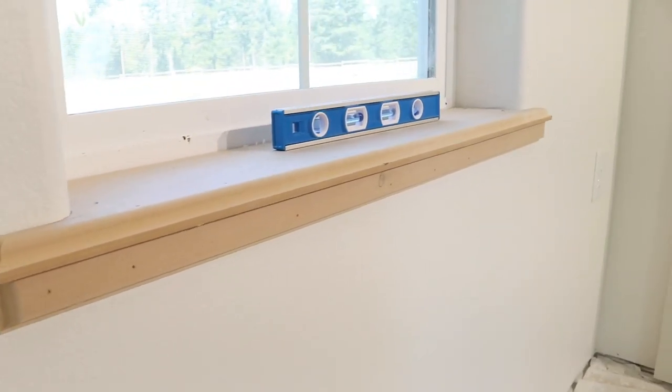I'm in the kitchen. I've got the same window sill, same skirting. Something to consider in here is you may want to go with a larger area in the kitchen because it tends to fill up with knick-knacks and different things above the sink. The other thing to consider is how close your cabinets are going to come to this window. In other parts of the house I've got a two-and-a-half-inch wing out here, and in the kitchen I went down to two inches. All the windows in this kitchen and living room area are at two inches.